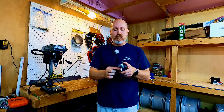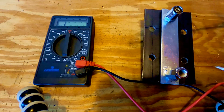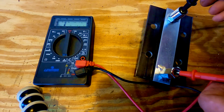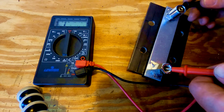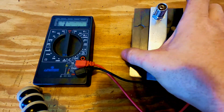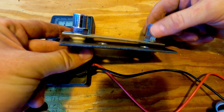I don't have my u-bolts on here yet but they'll be added in a moment to attach it to the mast. Let's do some testing with the ohmmeter. We're going to measure the center pin that passes through to the other side - make sure it's isolated from the other side of the dipole. That is isolated. How about when we measure the outer shield? The outer shield is showing continuity. The center pin passes through to this side of the dipole, and the outer shield is connected to this bar that goes to this side of the dipole.